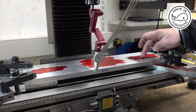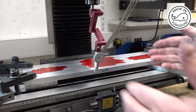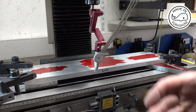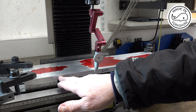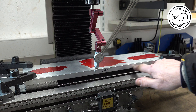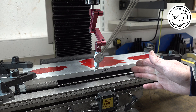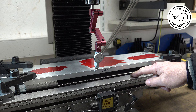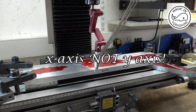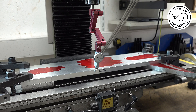This is the rear plate and I need to drill the holes for the bolts to go through to bolt the rear plate to the side plates, which will then be bolted to the front plate. I've run this gauge along the front here and got it spot on. There's one drawback with this mill I've found: you can't run the power feed on the Y-axis without the spindle running, which would have been great. So you've got to do it manually — a bit of a pain really.